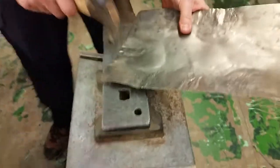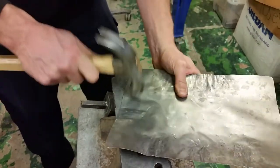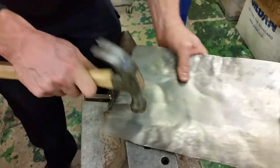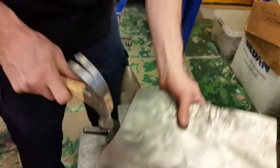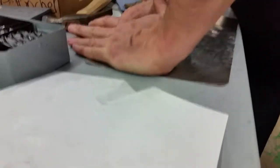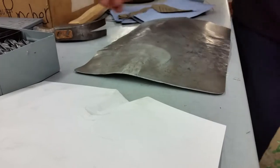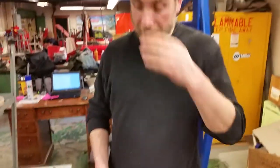I've got a couple of crinkles on the end here. I'm averaging it out a little bit — sorry about the noise, you can just turn down your volume. Now I've got this area that will not release and it's pulled in like that. You might think it's just dented, but it actually is thicker and shorter in distance. That's shrinking.